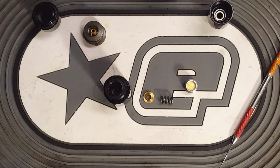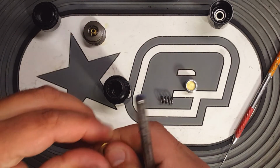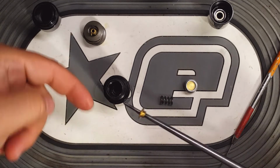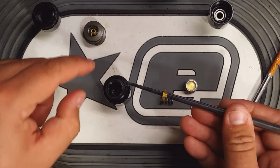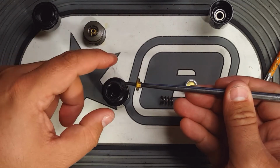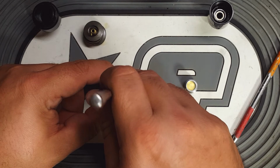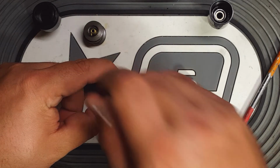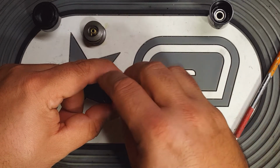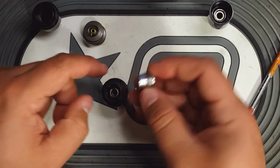going to want to put the top hat in on top of it. The top hat goes in with the top of the top hat facing the bottom of the reg, so if you put it in, the flat section goes first. I usually find you put it on a long punch or an Allen key or something so it falls down in where you want it to go. Just make sure it's seated in there. And the small spring and your new reg seat assembly.